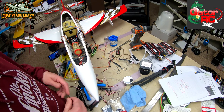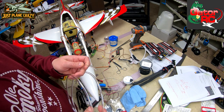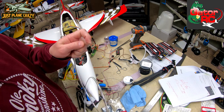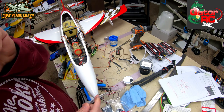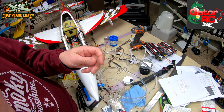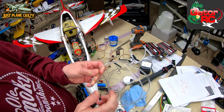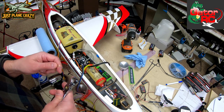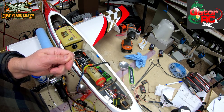Thanks to Jan Berg and my buddy Ronnie London for throwing ideas around. Six millimeter tubing — 4mm ID, 6mm OD — if you heat it, it works really good. I've been messing around with it: heat it, put it on the fittings. But there's a lot of tension in the line going anywhere else. For tubing cuts, straight cuts are imperative for no leaks if you're using Festo fittings. I don't want to use a bunch of 90-degree fittings — I think I can heat and mold and hold this stuff. Get your layout set in the jet the way you want to route things and we're going to heat and play with the heat gun.